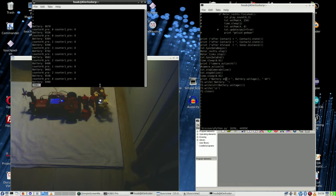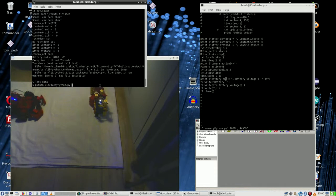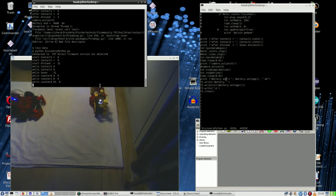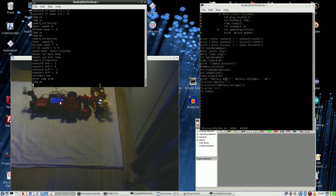Which is that it is now at 8.4 volts, which means that each iteration costs about 2/10 of a volt. Interesting. But still no explanation on why it stops. So go again. Yeah, go, go, go. Again, no hit. Oh, that's difficult. It's now suddenly 8.5 volts. Curious.